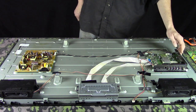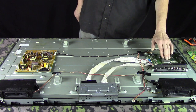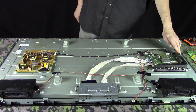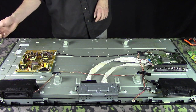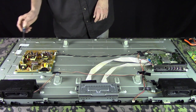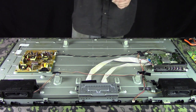With the video board, there are only a couple of really small capacitors — I don't see any chance of getting a decent electrical shock from that one. This power board, however, has one really good-sized capacitor and some smaller medium-sized ones, so just be careful.